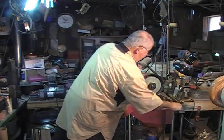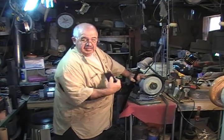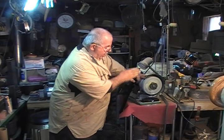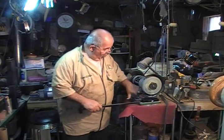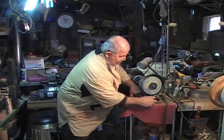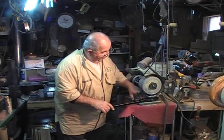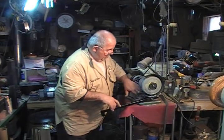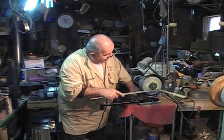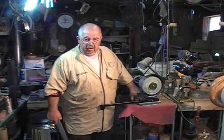Now what I do is start laying it out with a base. This is a base. It doesn't matter if you put it on the right side or the left side because it's symmetrical — it doesn't matter. The base needs to go centerline of the wheel. The way I do this is put one screw on this end of the base, put the longest arm in, and then align it by that. Now here I can visually see that I'm going to be centered under the wheel, and I put one screw in. Then to make sure I'm centered on the other end, I take a straight edge across the face of the wheel and make sure I'm parallel. When I'm parallel, I'll set the back screw. That's the first step.